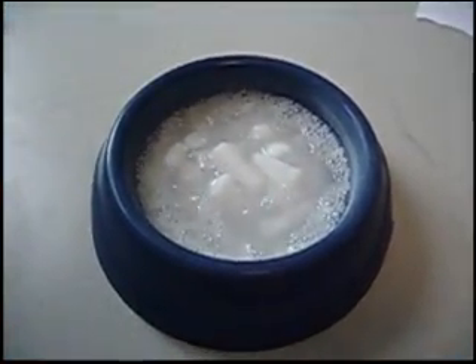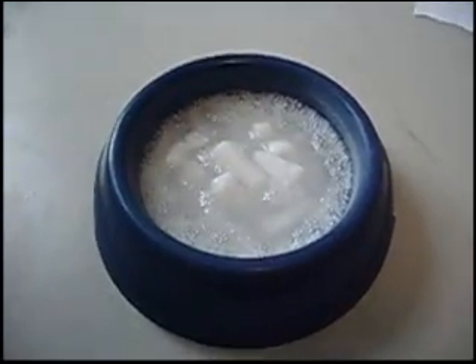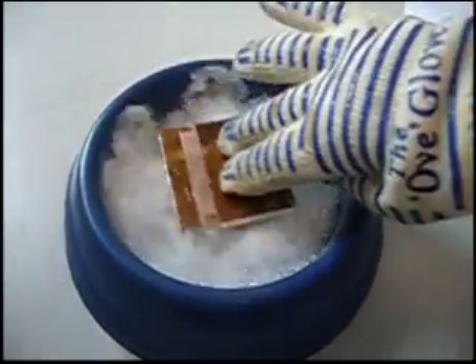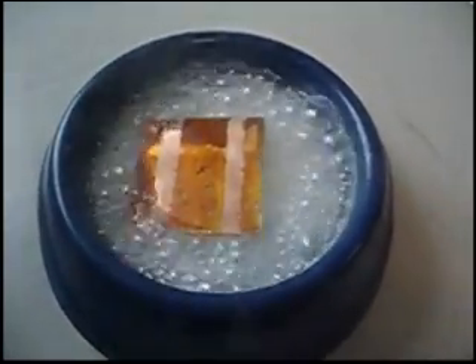Now we have the PCB substrate bonded to the aluminum. It's going in hot — that's okay. Once again the top and the bottom are seeing different heat profiles, so the CTE mismatch can be much greater. We do have the bottom line taped so the toluene does not leach in like it did during our last test.